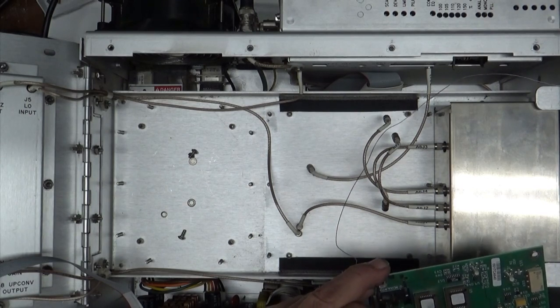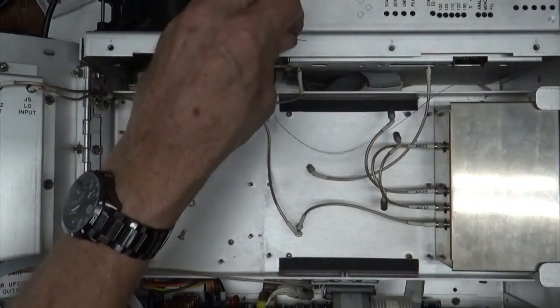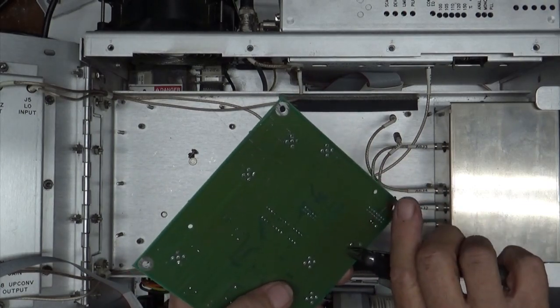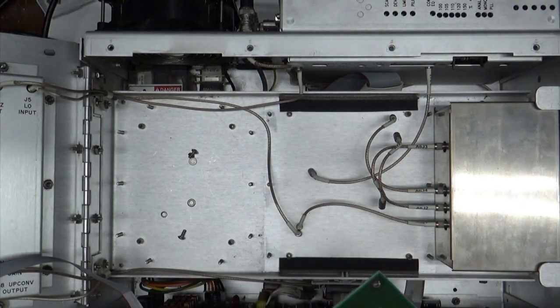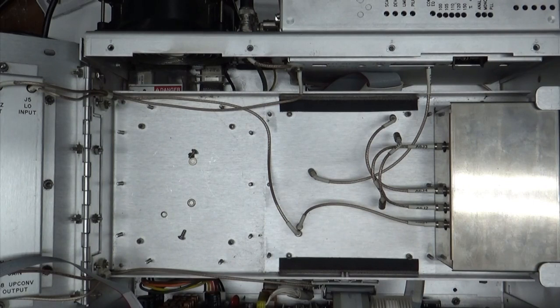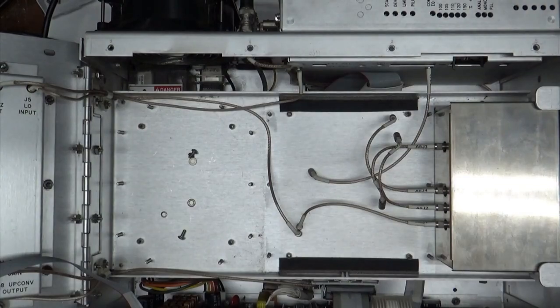This is not used as a fuse. This is used as a brute force dropping resistor, and I disagree with that immensely, but it's done all the time. If you want to do voltage regulation, don't just drop the voltage by brute force like this, please. Because they burn up.